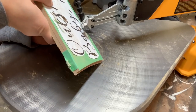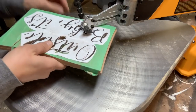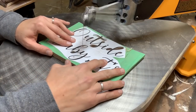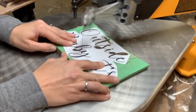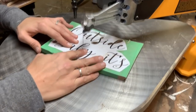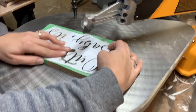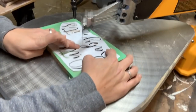I'll do the same thing in the larger cuts. This is sometimes why it's better to feed from the top — I've just always fed from the bottom by habit. Even for these bigger parts I'll still do the out-and-back to get that really sharp corner. Go into one side, back out, then come around the other side for a nice sharp corner. Then turn your work around, find your line, and continue on to complete the cut.